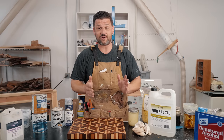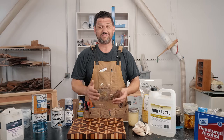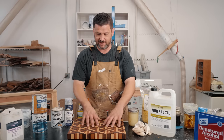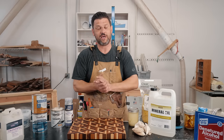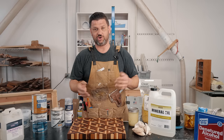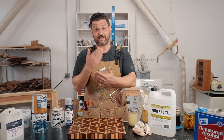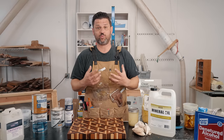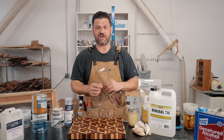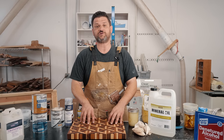It's amazing because you just wipe it on, let it sit till it completely soaks in, put on a few more coats on a new cutting board, and just buff it out. The finish is just special — I've never had anything that looked and felt this good on a cutting board. Now it's not durable on furniture pieces or jewelry boxes, but with shop furniture I really like it because I can reapply at any time. And it's got that wax in it, so my tools slide really easily — shooting boards and different stuff where you're in contact with hand tools.